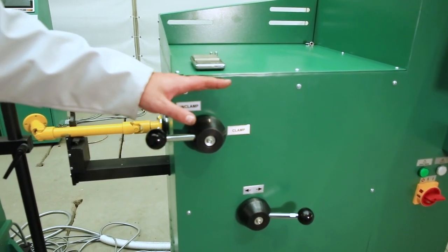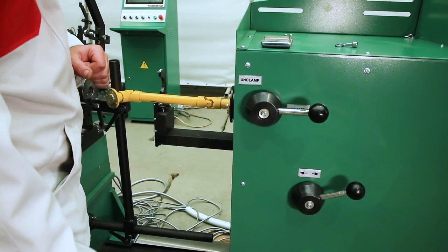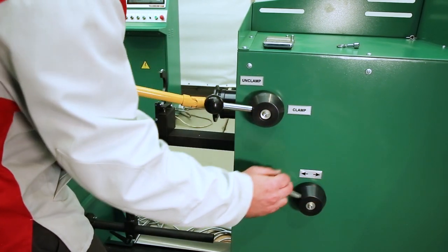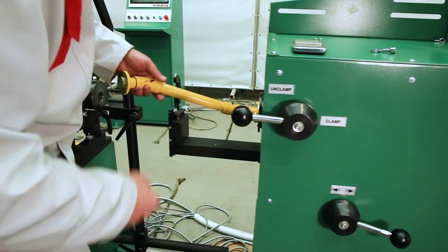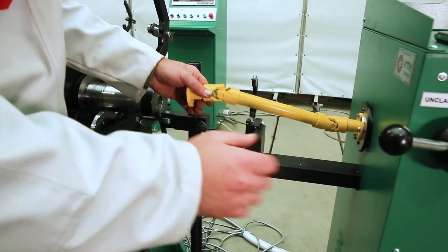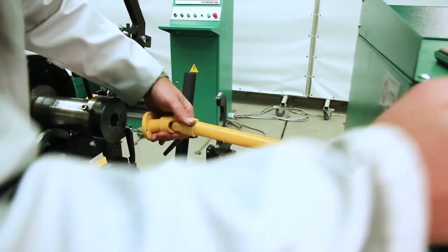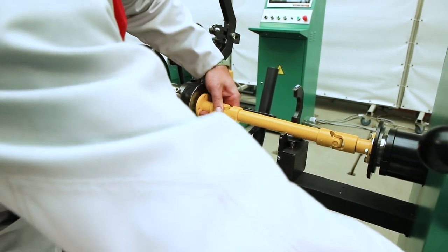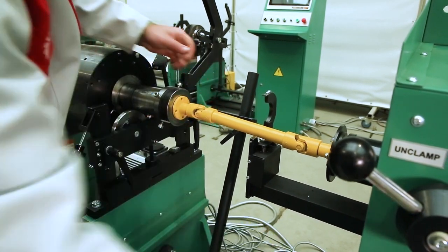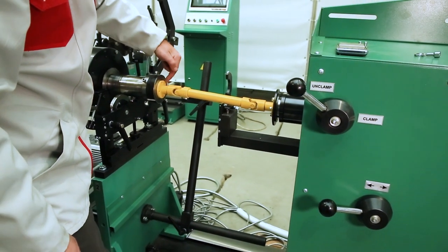The pinoli and pinoli fixation are installed on the headstock. In order to move the pinoli, first loosen the pinoli fixation, then move the pinoli. We connect the gimbal shank with the part, and after positioning we fix the pinoli. We fix it with bolts and clamp the pinoli.